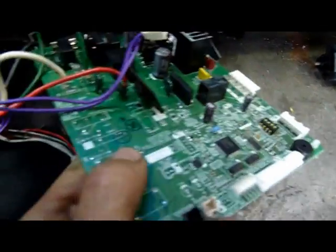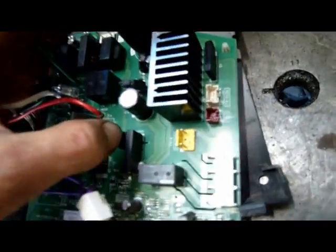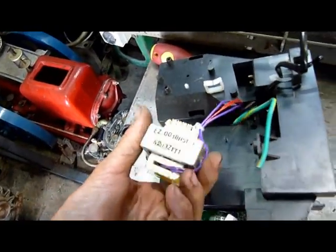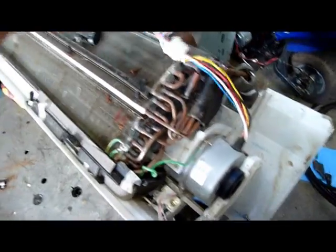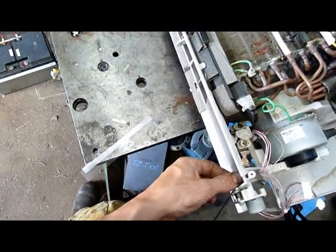Not sure if that means anything to anyone. There's another component there — it's not a rectifier, possibly an SSR. Either way there's not much else. There's a baby little mains transformer, 240 to 12 volts — too small to be really practical for anything other than a basic control supply signal. There's a fan capacitor that goes straight across there. Fan runs three speeds — well actually two speeds: common, then high and low. And there's a little stepper motor for controlling the flaps, same with that one there.